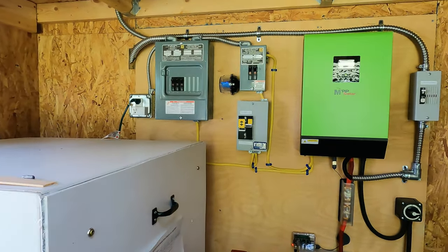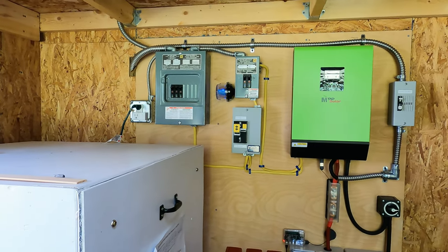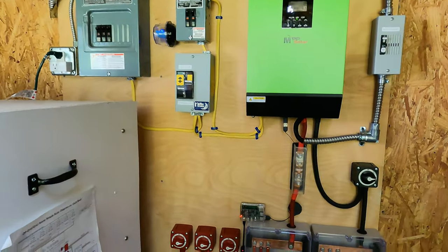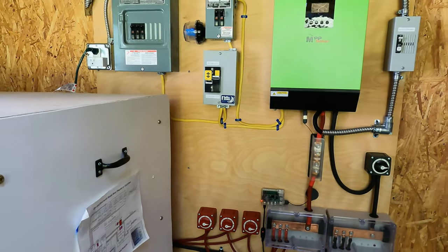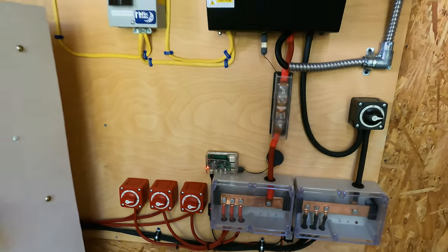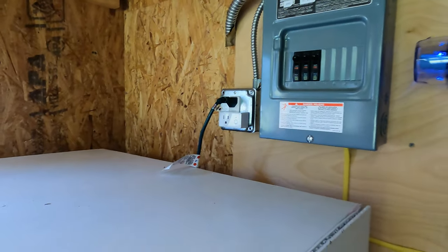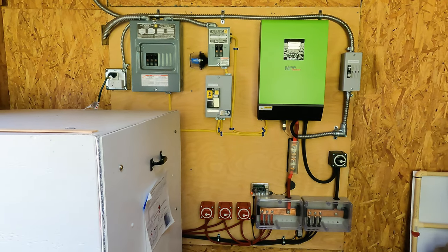I just shut off the fan — I want to talk about the options. There are actually three options: I can run the fan directly off a solar panel — thinking about using a 12-volt panel since 20 volts is about the max in full sun, which is right about where the fan is sitting at 19 volts. Or I can run it directly off the off-grid power system here, which is 24 volts — I can dial it down with a buck converter or run it at higher RPMs. I can also tie right into the bus bars. I do like the smart Alexa configuration to set schedules. So three options: running off AC with a smart switch, off a solar panel when there's sunlight, or directly off DC — the most efficient. We're not talking a lot of watts here — about 20 to 25 watts max.